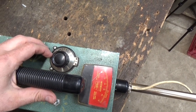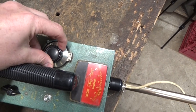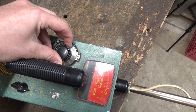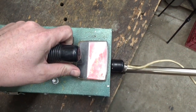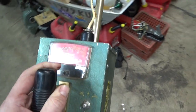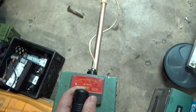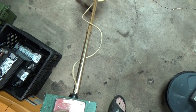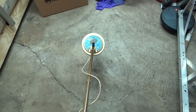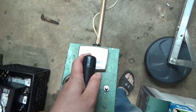So for iron, you turn it towards the mineral direction until it stops buzzing, and then you turn it barely back until it's just barely buzzing. Now supposedly this will be calibrated for iron or ferrous things and will ignore non-ferrous things. So we'll try our railroad spike — that works. We'll try our copper — that works too. So not quite calibrated correctly.